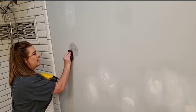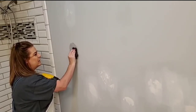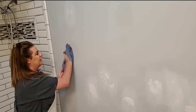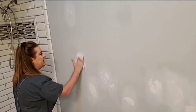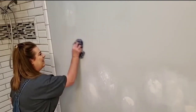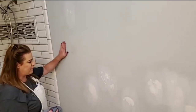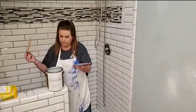This entire process of removing all the birds took me about 30 minutes — the time wasn't so bad. The patches you see on the wall are because I had some towel hooks and I went ahead and patched those holes. After scrubbing with the steel wool and Goo Gone, I came back with a rag to wipe away the mess, then cleaned the wall, and used water to rinse away any cleaning residue so the wall was nice and clean to accept the new paint.